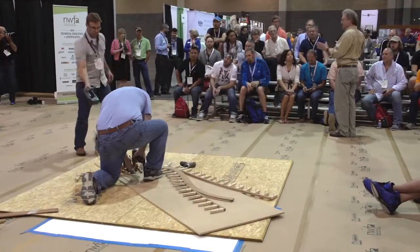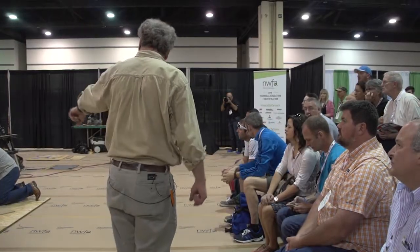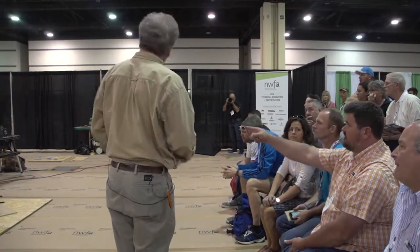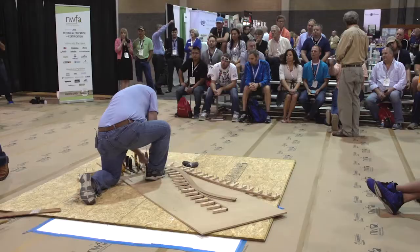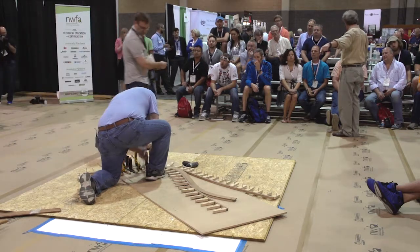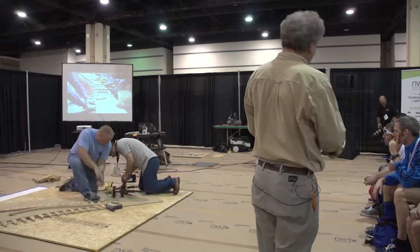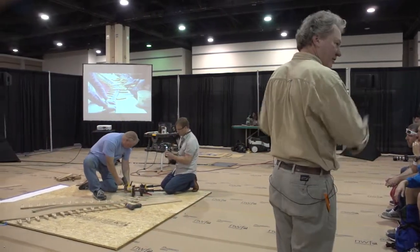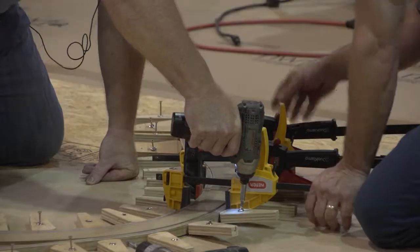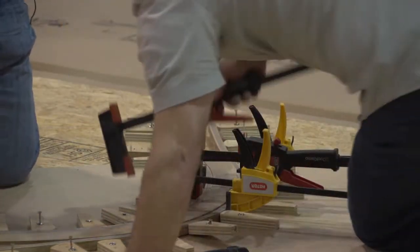Right, so what I do is I cut the paper, I mark it with the Sharpie, and then set the form on top of the paper, yeah. And then those ones that they're adding there now, that's pushing that. Yeah, those eccentric clamps are clamping against the form, which I would screw down to the work table. And I just leave the paper in place. And that way, even though the plywood's under it, the glue's going to leak down. The paper's like a release film, and allows the whole thing to come up. So I can make the curve to fit the layout.